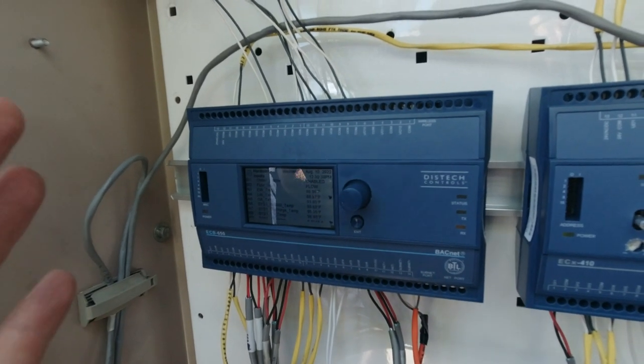It's just too much load — that loop can get so much load on it that the condenser can't keep up with the circuit. We have 150 psi suction, which is like 82-83 degrees of saturation, and that's really high for a single circuit. We've got it fully unloaded — the slide valve is not engaged — and we're pushing our current limit. The compressor is exceeding current limit because of the pulldown, and that's with no slide valve.